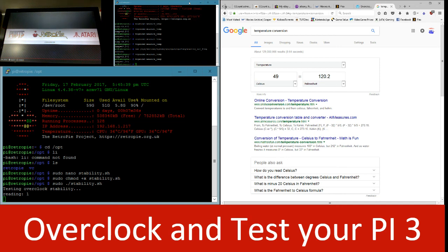Also, you can kind of see safer areas to put that on the board when you're putting the heatsink on. You can see some areas have no traces or anything, so obviously that would be a better spot to do it, just in case something happened. I've tried out a few different heat sinks and been using just a tiny dab, just enough to hold it in place, and removing the heat sinks is no problem. It doesn't do anything to the board. So anyways, I'm going to be back when the test is done.